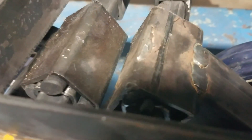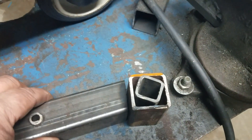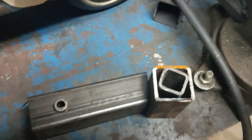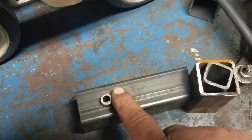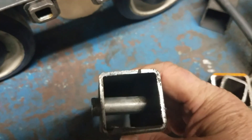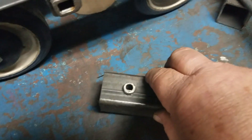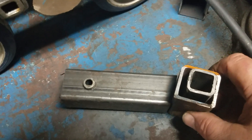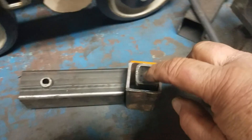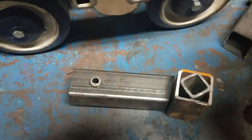If you look closely you can see the rubber cord. Here's how I made them. I took square tubing here — I'll give you some measurements at another time, this is just a brief update. Here's the arm where the wheels go through, a 5/16ths bolt. I put a little axle housing in there, half-inch diameter steel tubing. And this is a little bit more than a 45-degree angle. Square tubing goes on the inside, rubber cord right here.